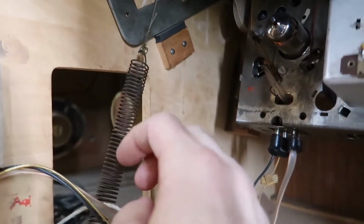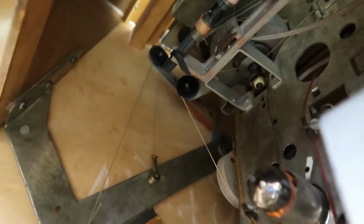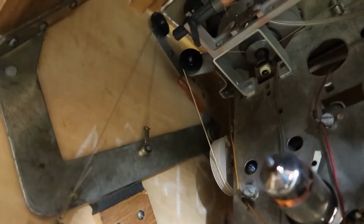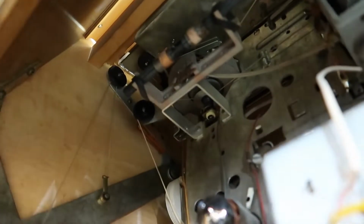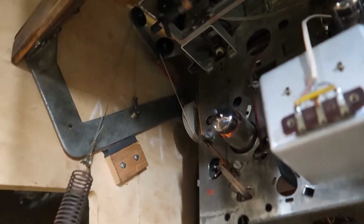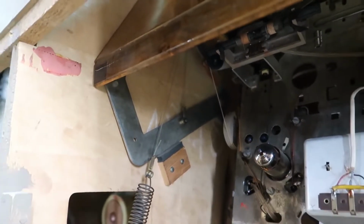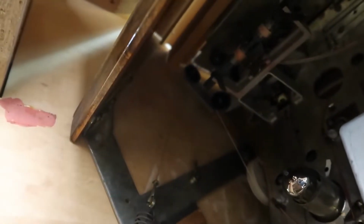And another thing that happens is there is this spring which holds the lid on, and it's really noisy. Why is it so noisy? Well, there's a pulley up there, and the cable clearly has fallen off the pulley. You can see it all the way up here, that cable is no longer on the pulley. So we'll have to get our hands way deep in there somehow and fix that pulley as well. Actually, that might not be too hard to fix because it looks like this ferrule here can come right off the spring. So I'll go ahead and fix that right now. Okay, I've got that string back on the pulley way up there, and now we are night and day, nice and quiet.